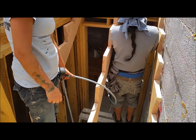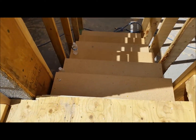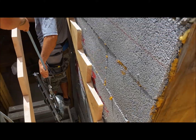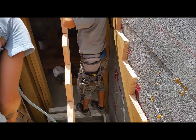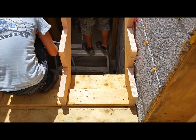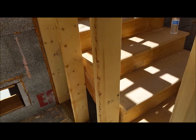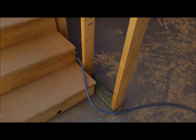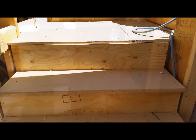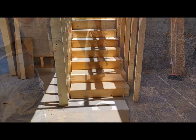Got the stringer set on the second lift here — there's a landing here and then the stairs going down. We just glued a three-quarter board in. You always put a three-quarter board behind your stringers so when you go to drywall, you can slip the drywall behind without having to cut it around all the stairs. Here's a better view of that three-quarter board — that way the drywallers don't have to cut their drywall around every step. Putting the last couple treads on now — stairs are all done.